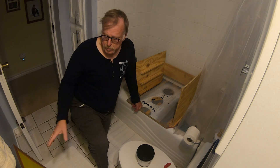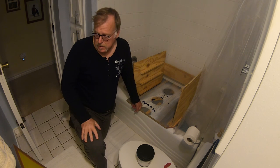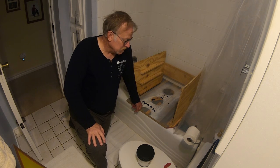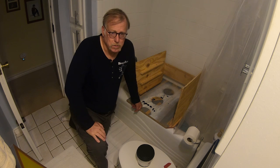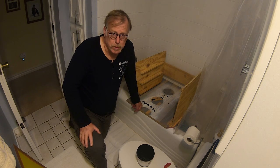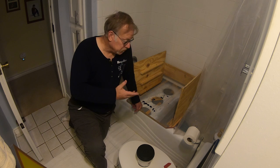Pretty quick. All we're going to do is put emulsion on the screens, which is liquid. It dries. And once it dries, or even through the whole process, it's photosensitive. So we've got to keep it under yellow light anytime we handle it until we expose it to a white light. What we're doing right now is just putting the wet emulsion on the screen. It's the same thing a t-shirt place would do. And this is Fred Flintstone setup.